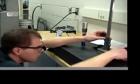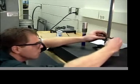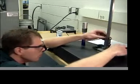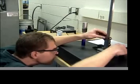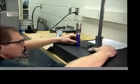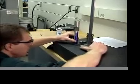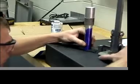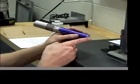Okay, so now I'm going to crank it up to 1/10 of an inch. You're going to actually work this backwards so that you get the dimension that you want instead of reading a dimension. You get it into the range you want, and you crank it down to where you want to be exactly when it lines up, and tighten both of those. Then we'll come over here and we'll scribe. Hold your screwdriver down very tightly and scribe a line where that first chamfer is. Now you can see that we have a line scribed 1/10 of an inch away from the end.